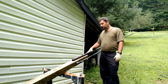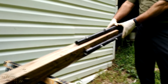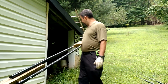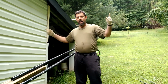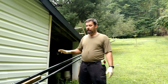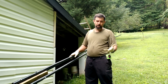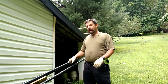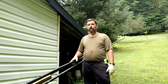We come up to here, and I've got my top rail posts. What I've done is cross-drilled through both sides of this 4x4 and attached four of these pieces with nuts and washers to it, and that creates the beginning of the metal structure. Right about here I'm going to have two 5-foot sections that run through these — they'll be braced and come off about 5 feet on either side — with parallel rods sticking up to hang the ham antenna, the 2-meter antenna I have, and a TV antenna I just picked up. That'll let me pick up maybe one or two stations out here. I may also try to do a cross for an experimental antenna, since I do have a small AM radio station transmitter, so I might put an antenna for that on here as well.